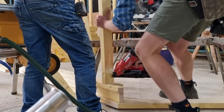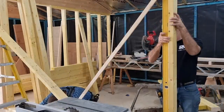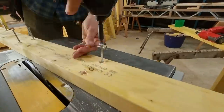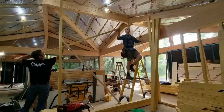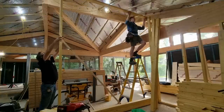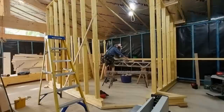One of the things I really love about the True Stud product is the fact that there's no sorting or checking any of the lengths. We literally pick them up from the packs, cut them, and get them fixed straight into the wall. We're fixing a head plate here from above, sliding our plasterboard in over the top, so we can pretty much pre-prepare everything, cut all the studs to one length, and it is super quick. The amount of time we're saving on this job by not having to sort through timbers is incredible — this job was so quick, and we're pretty quick at stud work anyway.